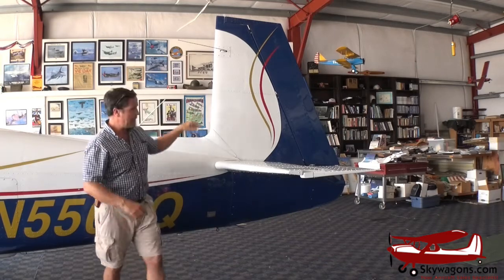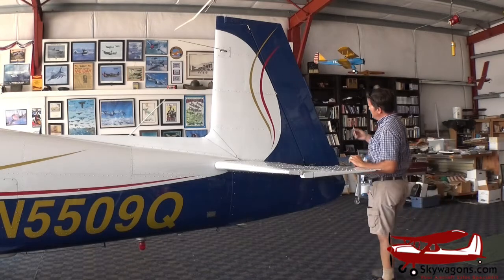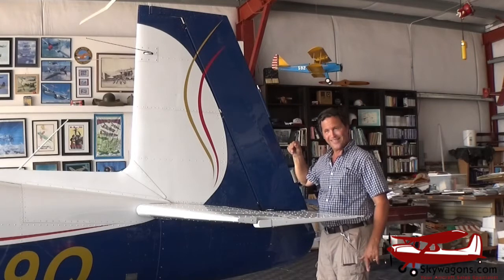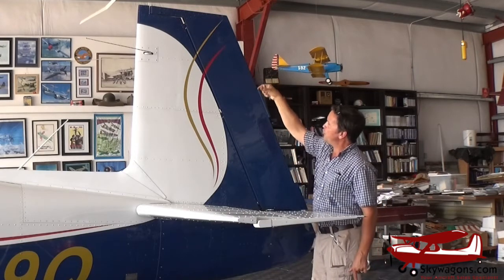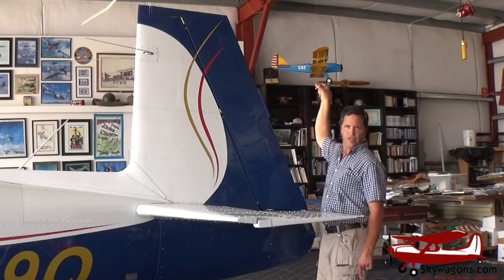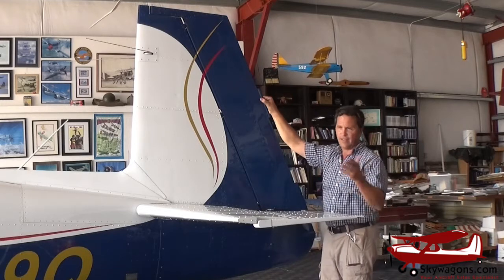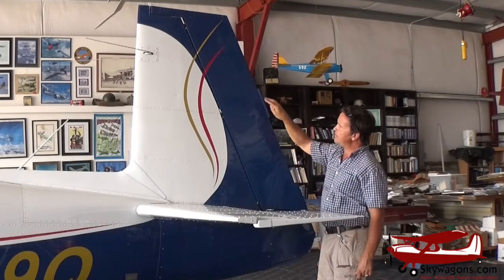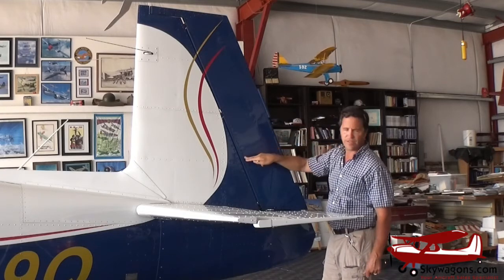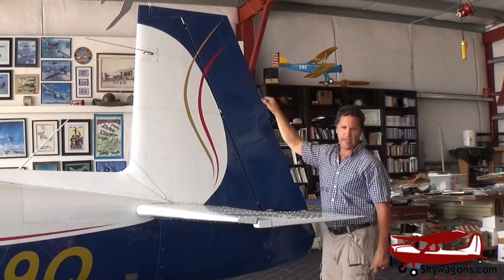And then lastly, on the back, over here, there's a very useful feature not many Mooney owners know about for holding your pen. Or not. That is actually a little tube on the back of the rudder of the early flat-skin Mooneys to break the suction. As the airflow comes off it, it breaks the suction, reduces the drag, and enhances the speed. That won't be on any rudders that have the flutes in them, which would be on later Fs and Gs and 201s and the faster Mooneys. So that's an amusing little aside that I always like to mention.